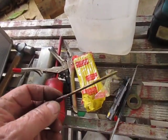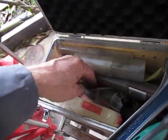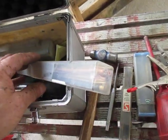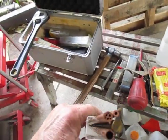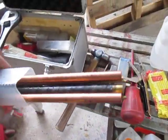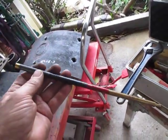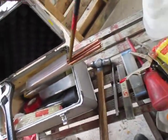The electrodes are just brass wire of all different shapes and sizes and lengths. Some of them are copper. Some very long ones that are hollow. Some of them are solid, depending on the jobs. This one here is one that I've used — let's see how long it is and how deep I had to go down in a hole with this particular electrode.